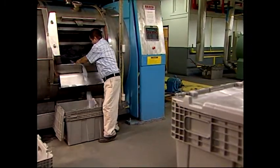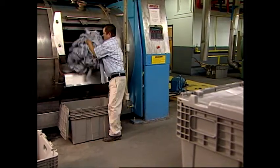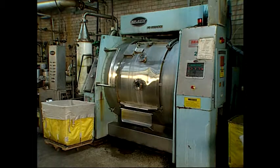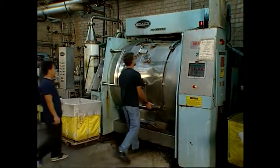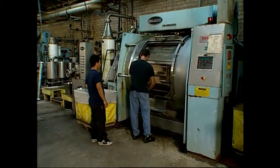The key advantage to side-loading rotary drum machines is that they require relatively little water to operate. This rotary machine has just completed dyeing a lot of men's dress cotton socks. The operators step in to doff the dye lot and load the next lot at the same time. The machine has three inner compartments.